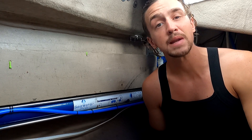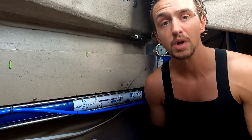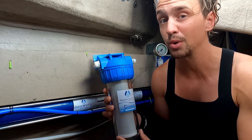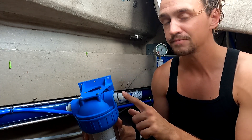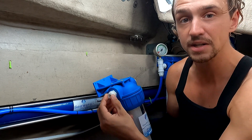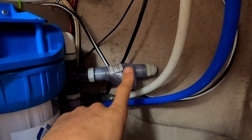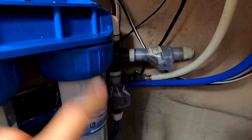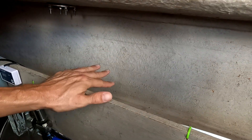Another option to make fresh water is if you're at a marina but don't want to use the seawater around you or move your boat — you attach a carbon filter from the hose provided at the marina into the system. This will remove things like chlorine that would be detrimental to the system. You plug it in here, and it connects with a push-to-connect quick connect PEX pipe. That quick connect goes right here into another one-way valve. It would not be able to go down because of the other one-way valve, and it would then run purified water through your pre-filters, getting it to the correct PSI, feeding the boost pump, going through the membrane, and giving you your product water just like normal.